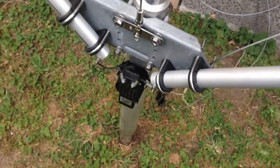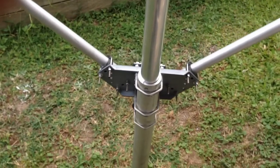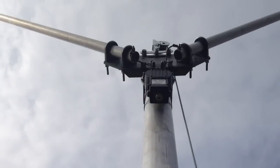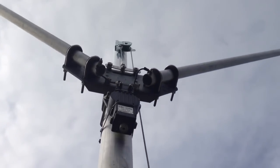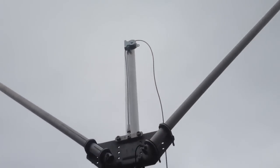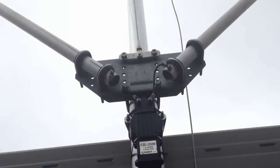And the moment of truth — a little bit of testing with the cable and the pulley. It slides up and down. You'll notice the second time I give it a pull that the antenna rotates right about there and swings around because of the slack in the cable. You'll notice though, as the assembly gets toward the top of the mast, because the pulley is centred there's less tension in the cable and the antenna tends to correct itself. So I might need some sort of notch for a locking mechanism or I might get away with it. So I guess there may or may not be a part two to this video, but I think that's enough to sort of explain what's going on.